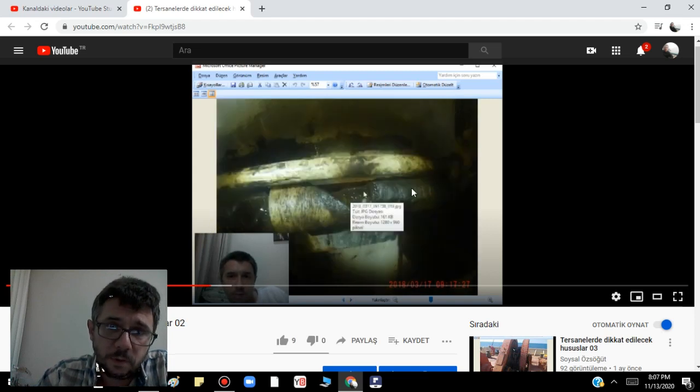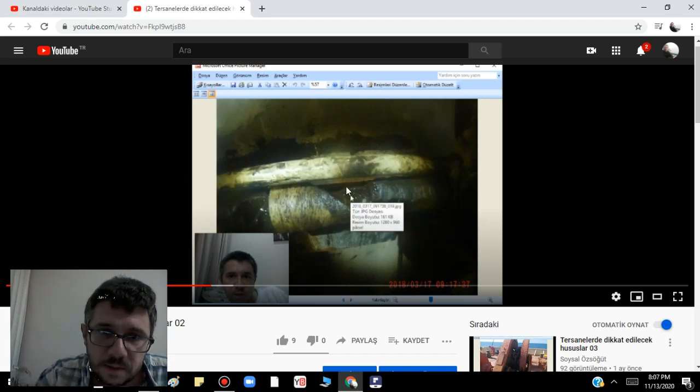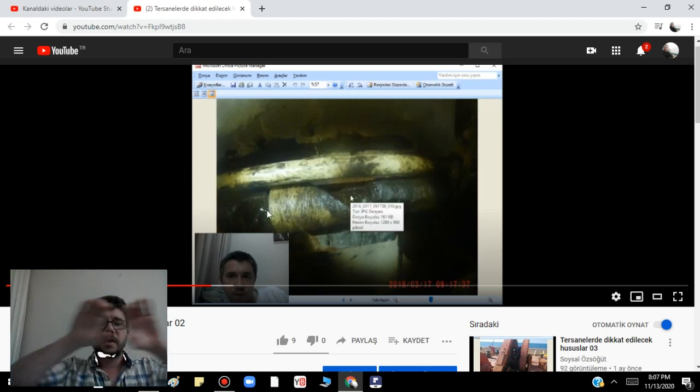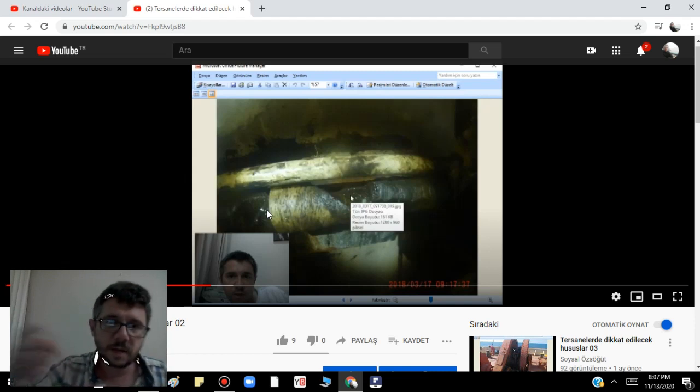This is another typical problem of the McGregor crane. By the time when they are running, the grease goes inside with the cargo dust and it becomes stuck up, not turning anymore. But the wire is still running on it, so you see here it already ate the Teflon rollers. What I recommend: if you don't have any spare rollers, just take them all out, clean everything, and when putting back, because the corners will be in good condition — the wire running area is here, not in the corners — select two or three Teflon rollers in good condition from the corners and put them in the middle working area.